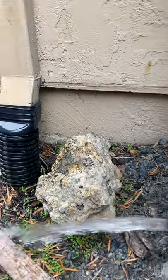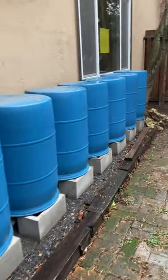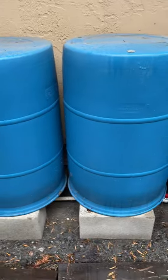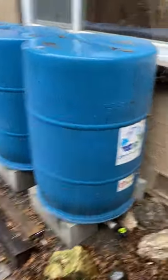At half full you'll see the water comes out real strong — oh yeah — so that's plenty of pressure to feed a gravity-fed drip line. We have lots of info about that at bluebarrelsystems.com. All of these barrels are plumbed underneath, so they're actually all filling at the same time. That one downspout diverter serves all eight barrels in the system.